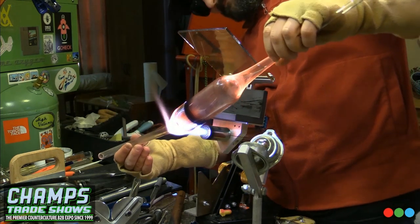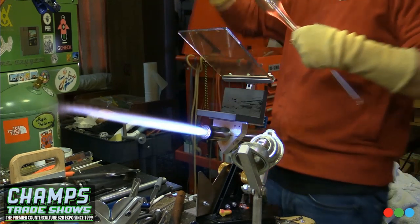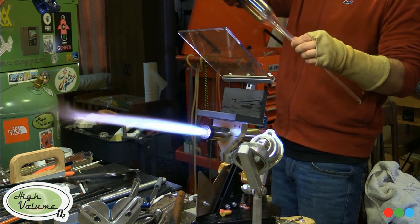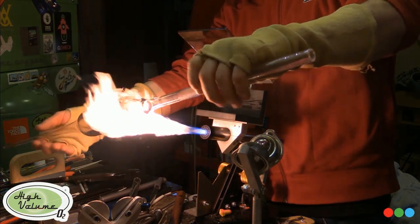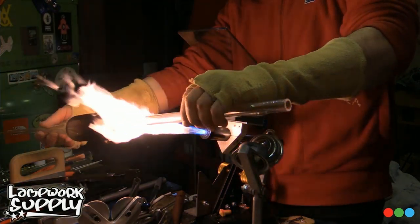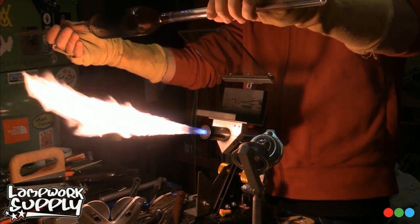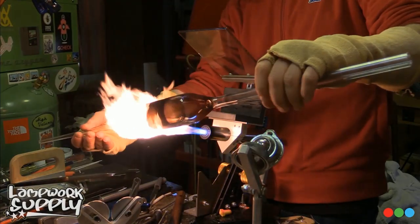There's two types of stress. There's thermal stress and there's mechanical stress. They can play off of one another, but those are two distinct things. Like a tube that's perfect stock, if you flash it, it's going to get that big spider crack. That's thermal stress, 100%. There was nothing to set it off. When your ring seal is all janky, and it's got a bunch of thick glass here and a little tiny tag on there, that's mechanical stress, or when you carved it and it checks. Even checking is a form of mechanical stress, because the glass is pushing against another layer of glass and it doesn't have anywhere to go. So it checks. It wasn't temperature that set that off. It was the physicality of it. So anyways, those are types of stress.